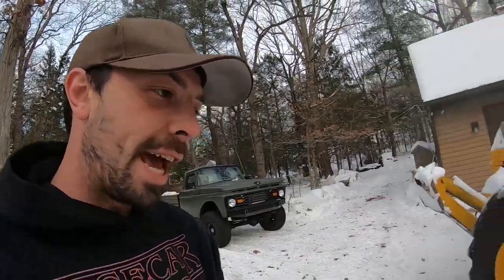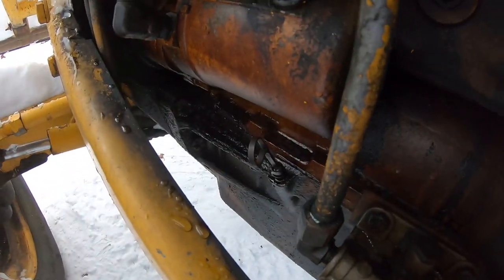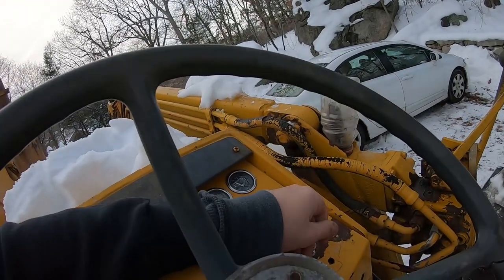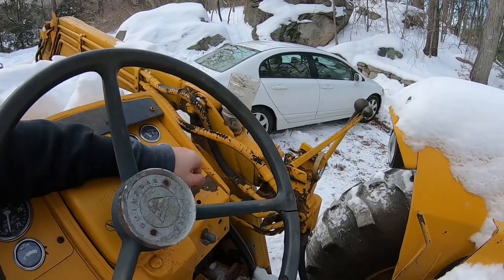Now, I think I mentioned that the crankcase vent is plumbed behind the driver just so the blow-by doesn't come out in your face. Let me show you that. So basically, all that smoke is blow-by directly. Now, that's not all of it. Although this crankcase is open to atmosphere, it even has enough pressure to blow out of the dipstick tube. I don't know if you guys can see that, but let me give it a little more gas just to make sure. So yeah, it's got a fair amount of blow-by, guys.